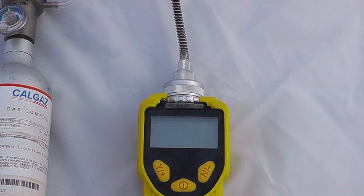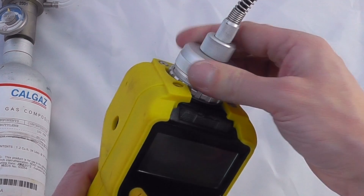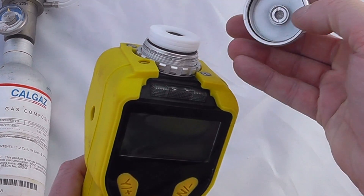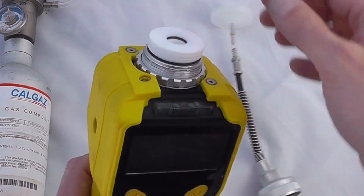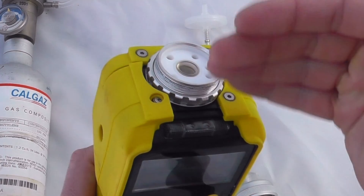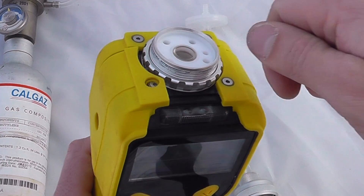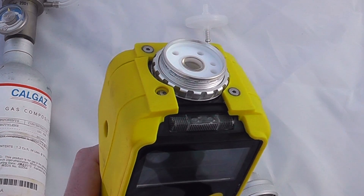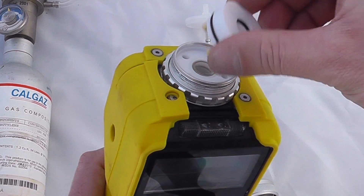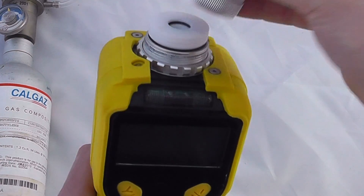Lamp cleaning is something that will need to be done frequently. To clean the lamp, unscrew the top section — this simply unscrews and the section comes off. You can see there is an additional level of filtration inside. Remove the sensor block from the top of the instrument and the lamp is now exposed. It's important not to touch the surface of the lamp — use the cleaning solution provided by Ray Systems. Then reattach the sensor block, making sure not to touch the top of the sensor block, clip it back into position, and reattach the probe.